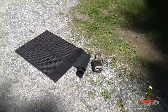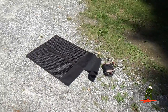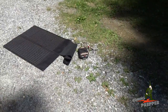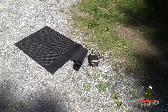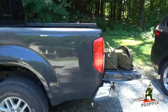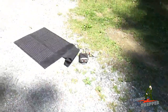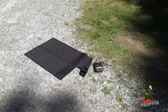I'd like to add a little addendum to this video. I got an email response from Bill at Harden Power Systems within five minutes asking if there was an internal fuse. He told me there was an internal controller shutdown, and all I had to do was hook it up to the wall charger or the solar panel and it would reset the unit and bring everything back online. Sure enough, the QRP Ranger is operational again. Once I came down off the mountain and had a clear spot to set up the solar panel, I hooked it up, turned the unit on, and it powered right up. So we're going to let it pick up a little charge, and instead of climbing back up that mountain, I'll set up a little tailgate operation using the F-loop antenna or the mil-whip here on the tailgate of the truck. My bad — I didn't read the manual on the QRP Ranger. But thanks to Bill for sending that quick response and salvaging my weekend video activities.